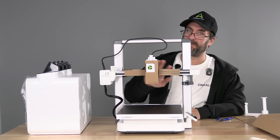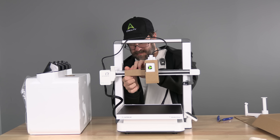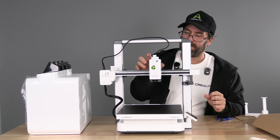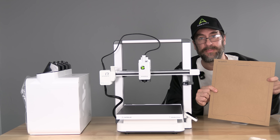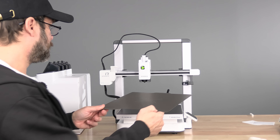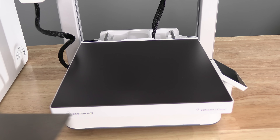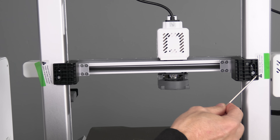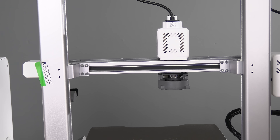Go ahead and remove the cardboard around the tool head — there's no real trick, just a bunch of folded up origami. Work it all off and the tool head should move smoothly. Remember that piece of cardboard? Inside it is your build plate — remove it now. This is a dual sided textured PEI bed; just slip it in and drop it into place. It's exceptionally easy, almost impossible to get wrong. Remove the two plastic locks by removing the four screws, find the Allen key that fits, take them off, and remove the two stickers.